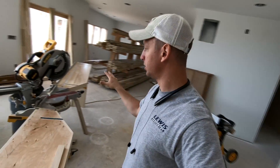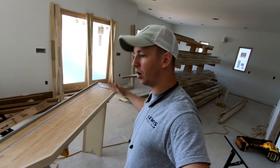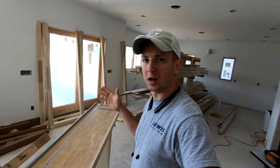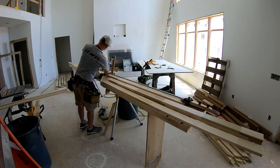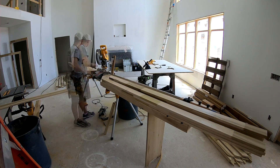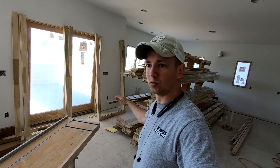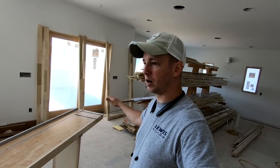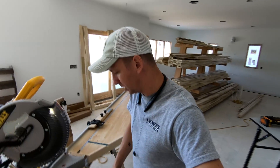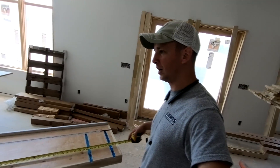I get asked a fair amount how long my miter saw wings are. The reason I chose the length they are was for two things: I wanted to be able to cut casing legs with my stop block for six- and eight-foot doors, and the second reason was I wanted to be able to comfortably cut trim without outfeed support stands. I can cut 16-foot base or crown with these wings just fine. From blade center to the end, I'm 93 inches on this side — so that's how long mine are.